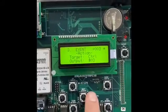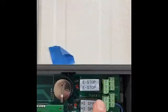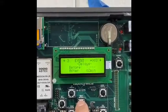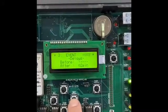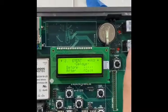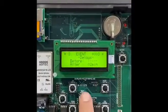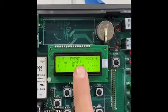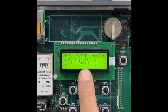Event three controls output three, which is relay number three — that's the high speed signal to our fan. We've got it on normally open, so it'll close upon alarm. I set this delay so that it runs for two minutes after the event is over; it'll continue to energize that for two minutes and then pull the signal away, so we'll run our fan long enough to be sure we clear the room. If one or more from all groups equals alarm A — our lower level limit — we'll kick the fan on.